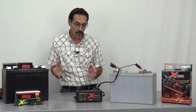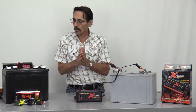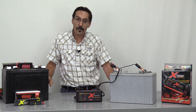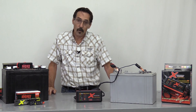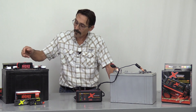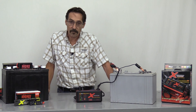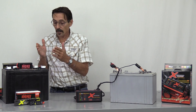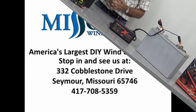That's what desulfators are supposed to do — when they break the sulfates off the lead plates, they turn those sulfates back into liquid, making your battery easier to charge and quicker to charge. For solar or wind energy, it's very important for a battery to take a quick, fast charge. I hope I've explained battery desulfators and what they actually do. My suggestion: if you get a brand new battery bank, make the investment and put the Power Pulse on it. If you can get another five to ten years out of that battery bank, they are well worth it, plus they take less energy to charge. I'm Jeff from Missouri Wind & Solar — thanks for watching.